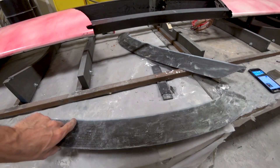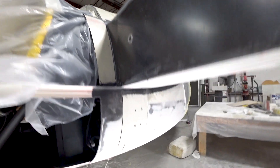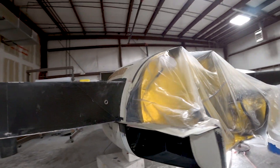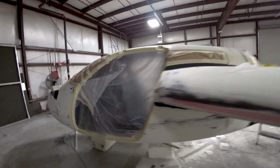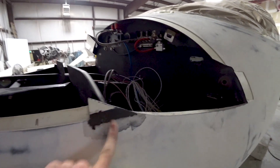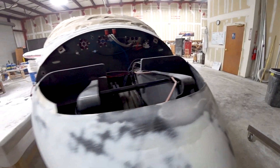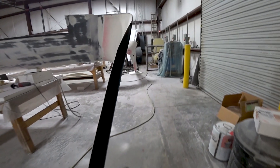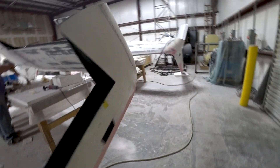Devon's working on the wing fences for the outboard wings, getting those finished and prepped for priming. Here are the results of my strake layup work with the peel ply taken off. This is the next day — getting the engine compartment prepped for painting with a little bit of masking, and there's the nose hatch with the little patches where those add-ons were. Jeff's already put a little bit of micro in there so things are coming along with the fuselage. And there's the rudder mount point on the winglet — that layup in there with the peel ply off and rough edges trimmed, giving us a nice solid mounting point for the hinges.